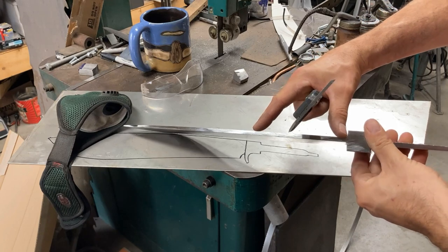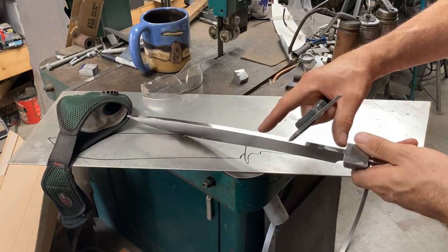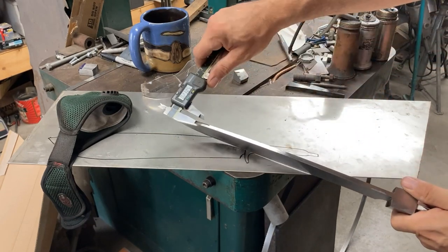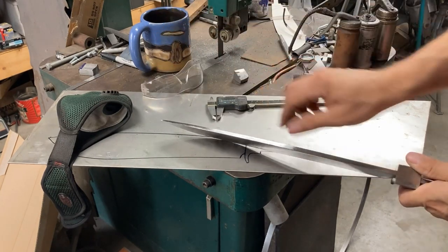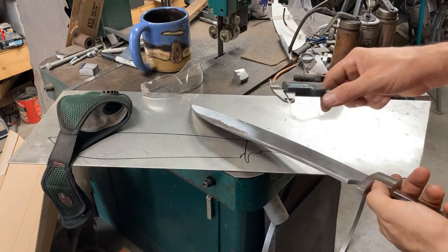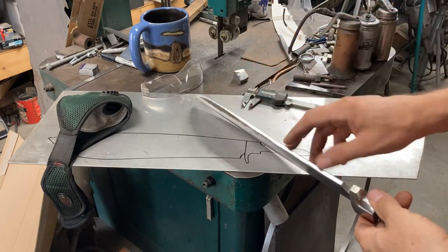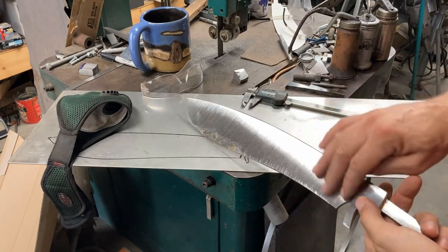235 — pretty much within five thou all the way down here, 230 to 235. That's good, just a little bit under quarter inch. And that's great — I don't want a big thick blade for this thing. I never like how a chopping instrument feels unless it's an axe if it's got too heavy of a thickness on the spine. Now by the time we get to the point we're at, 0.102 — so there is already some distal taper that we have put in, we'll put a little bit more in just to make the knife balance better. At the edge, 238, 240, 236, 223 — so also tapering here but within 10 thou of the spine. The edge is actually a little thicker so that's good, we got plenty of room to grind a nice blade out of this.